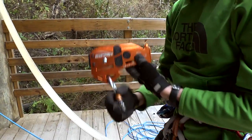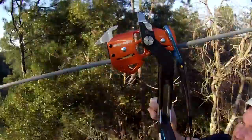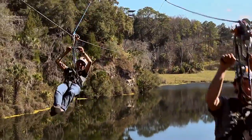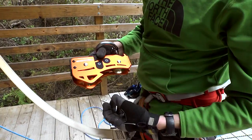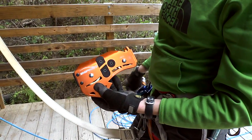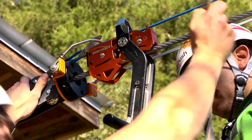The clip-in point for the rider is off-center, utilizing the rider's weight to keep the trolley on the cable at all times, especially during impact with the brake trolley. The trolley's impact surface is smooth, flat, and durable, minimizing damage to the brake trolley. The Impact Trolley includes a notch to place the carabiner for your rider's backup safety tether, which means your carabiner won't be dragging on your line and wearing out your cable.